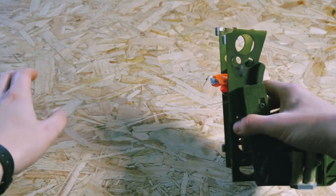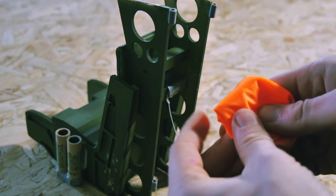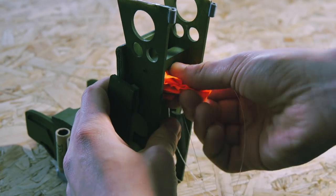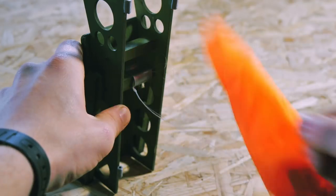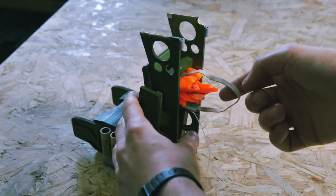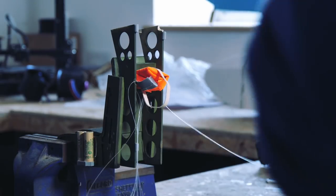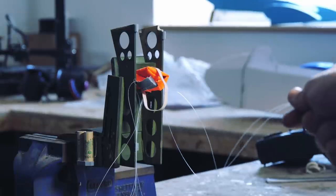To start with I made the drogue parachute system. The chute is folded up and stored in a space at the rear of the seat where it can be tugged out with little resistance. Like with some early seats, this chute is designed to be ripped out by a cord reaching the end of its line, so I used a rubber band slipped over this bundle to pull it from its stowage space.